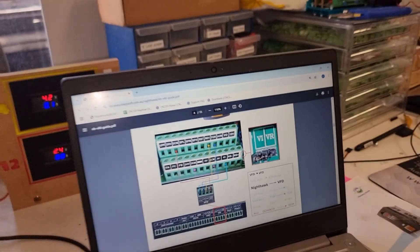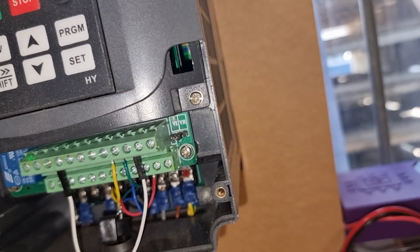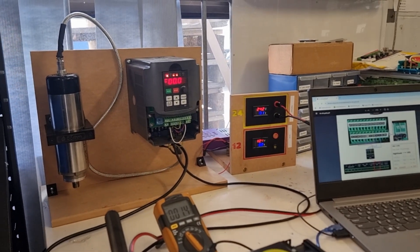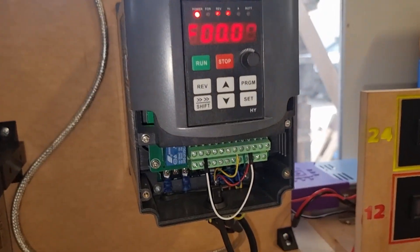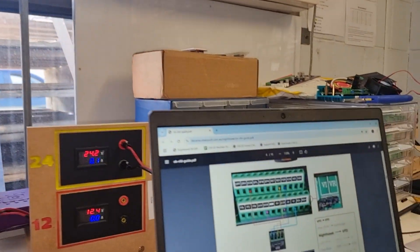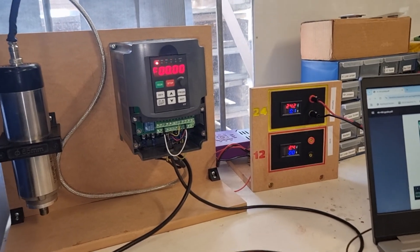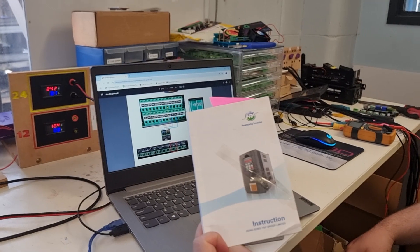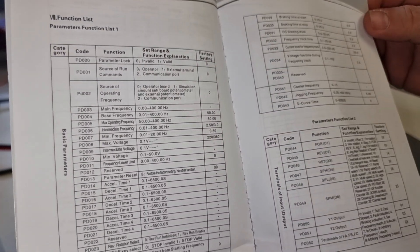You can see the VI and VR positions on the side of the VFD — make sure it is set to VI and not VR, a very common mistake. Another potential fix, which is odd across different manufacturers: the white wire bridging ACM and DCM — covered in the VFD cheat sheet with the pink bridge — you can try removing that bridge and wiring directly through to the ACM pin. Go through your manual as well; on page 19 of this particular model, all PD settings are listed.